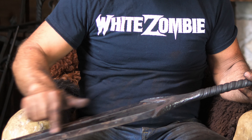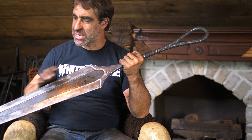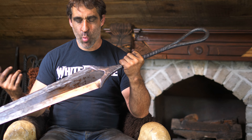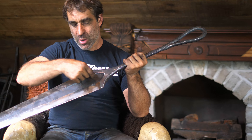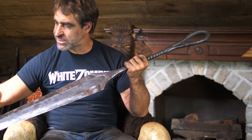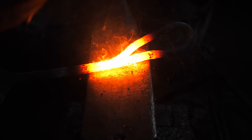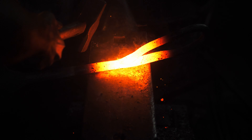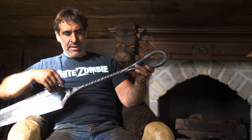Moving down the blade I put a really large fuller in, and the primary reason for that fuller is to lighten up this blade. I had this massive piece of steel and I was trying to bring it down to a somewhat practical weight. The most logical approach was to put a fuller in on either side — a kind of cathedral cutout, going quite wide and then tapering the fuller out as far as possible to make this whole thing as light as it can be. This is all made from one single piece; I brought it back on itself and did a forge weld to create it into one piece, then did my rope twist and blended everything in.